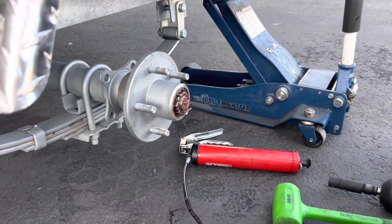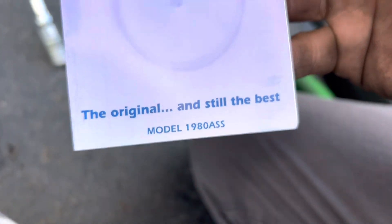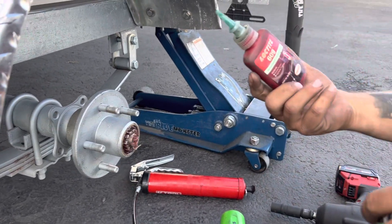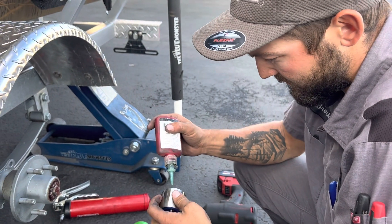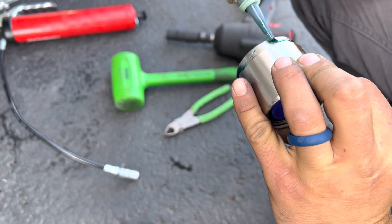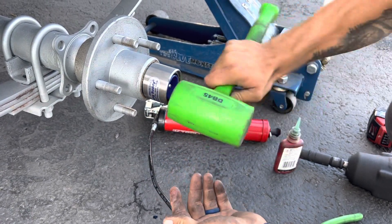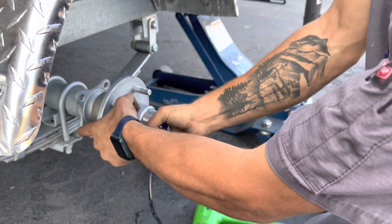Now you take your fresh bearing buddy kit. What size are these bearing buddies? They're model 1980A. That's the size we're using. All the G3s — 17s, 18s, and 20s — they're all the same size. I like to put a little bit of retaining compound on them just for an extra stick, just for any reason. The retaining fluid is like Loctite 609, just around the ring. You can see how he's doing that there. Tap it all the way around the rim until it seats. I always grab it, make sure it won't spin, won't pull off.